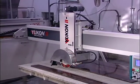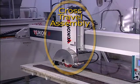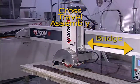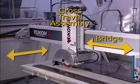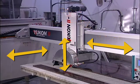The saw blade and arbor motor are mounted on the cross-travel assembly, which travels from side to side along the bridge, forward and backward along the gantry, as well as up and down. All cutting operations are based on these 3 dimensions, so it's essential that you understand the direction the arbor travels over the cutting surface.